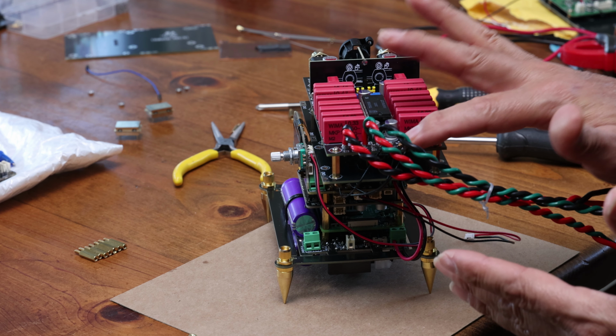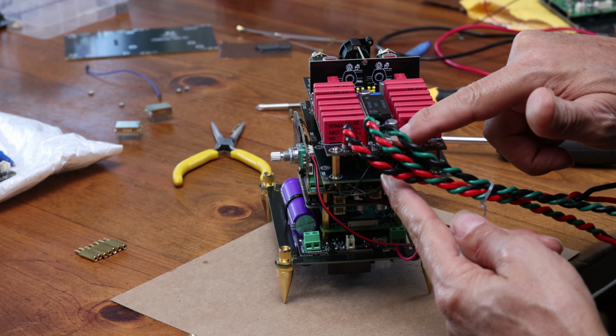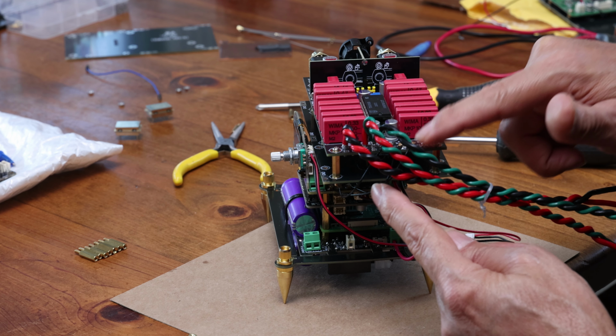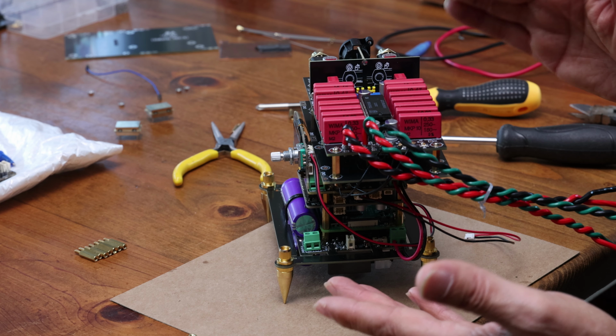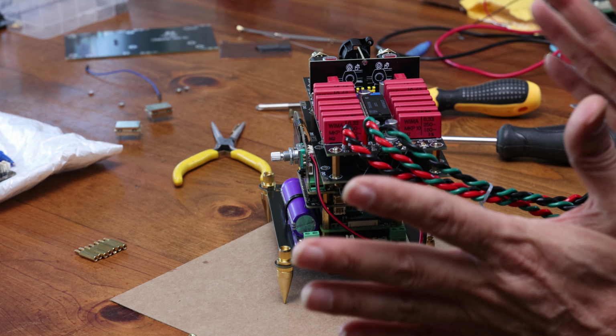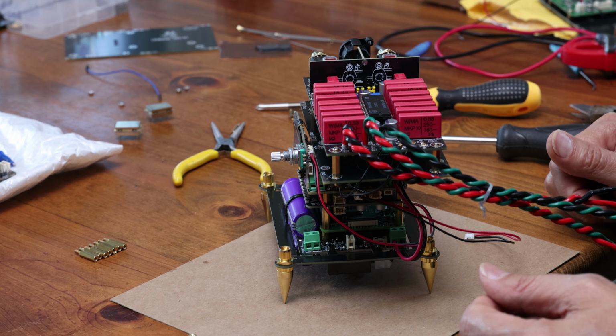The next step from 10 centimeter was 15 centimeter. That's a bit too long. The shorter these cables are, the better. But also they have to be the exact same length, so don't put like 1/8 and 1/10. They have to be the same length. There'll be problems with the way the frequencies come in.